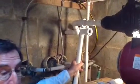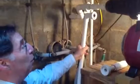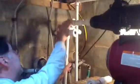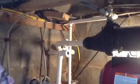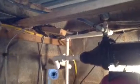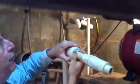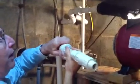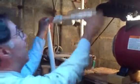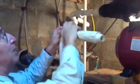And this little bucket will act as a cistern. You just keep it full, and when the pressure tank has gotten up to 40 pounds, this will cut off, and it'll be stable. And that way you'll know that the pump is working. You're bypassing all the piping that goes to the cistern. Very clever. That's a tester. So this tester fits all of the different pump configurations. That's why this is here. Sometimes you can attach it here. Sometimes it attaches here on certain pumps, depending on what pump it is.